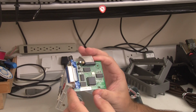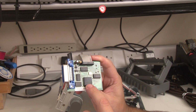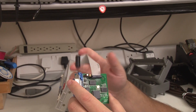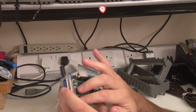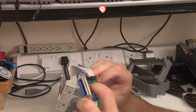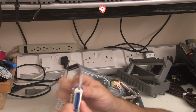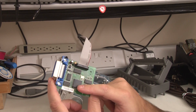So I'm going to guess, and this chip here is a NAT 9914, which is an IEEE 488.2 controller. I'm going to guess that's a 5-volt part, and the logic out here is probably 3.3 volts in the counter. So those are the level shift for the bus driver this way, and then these are the actual buffers for the output there. That's it. There's nothing else on there. There's a regulator, a bit of power supply circuitry. There's an oscillator here, a crystal oscillator, and that's it. That's about the size of it. So it's a passive interface with that intelligent controller on it.